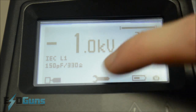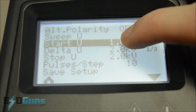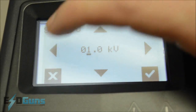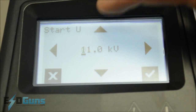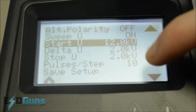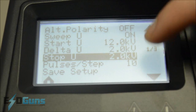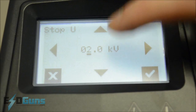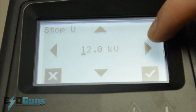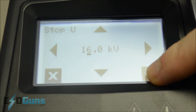The wrench is your best friend — it'll take you into the settings, and you can use the side arrows to scroll and highlight the item you want to change. Use the side arrows to select the decimal place and the up and down arrows to adjust the numeric value. Set the start value for this test sequence at 12,000 volts. Adjust the stop value to 16,000 volts.